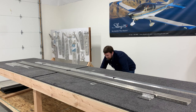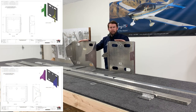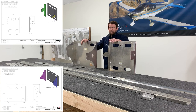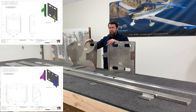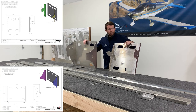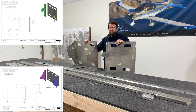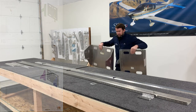The first step of the assembly manual is going to have you assemble your wing jigs. We've got the tip jig and the root jig. The support braces on the tip jig cannot accidentally be installed under the root jig — the hole patterns are slightly different so you can't make that mistake. All you have to do is make sure that your arrows are all facing up on both jigs, and you're using the left jigs for the left wing and right for the right. They're very straightforward and easy to construct.